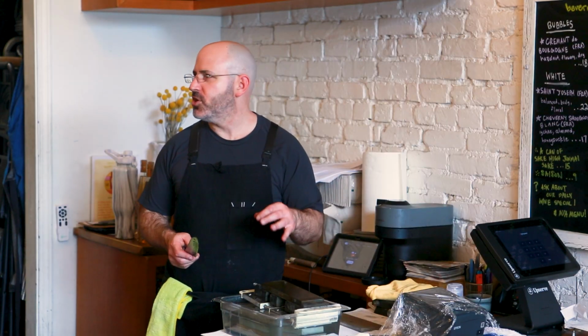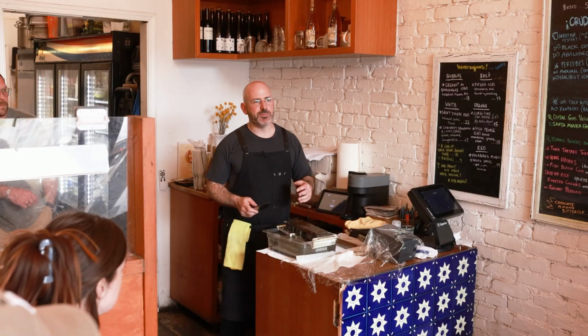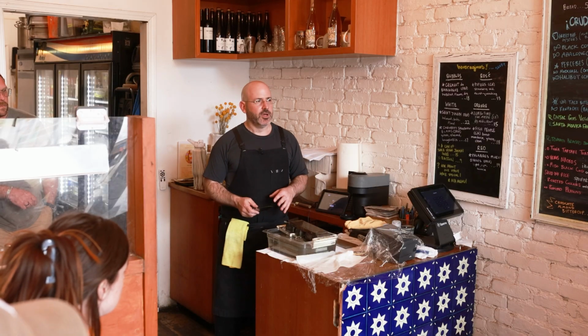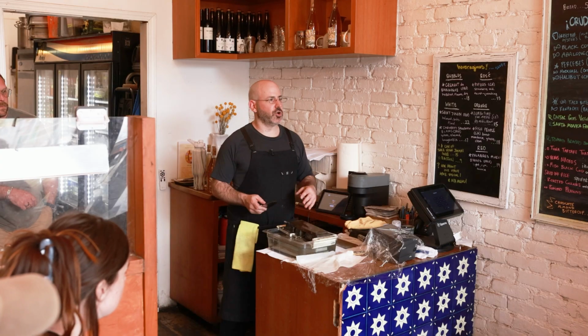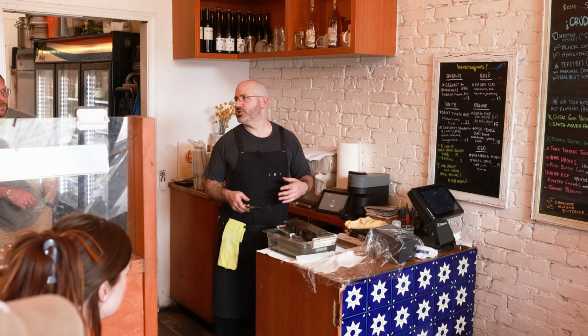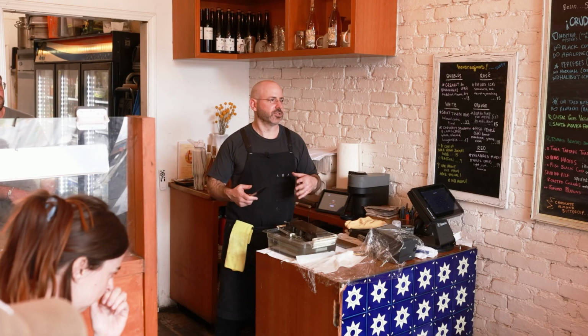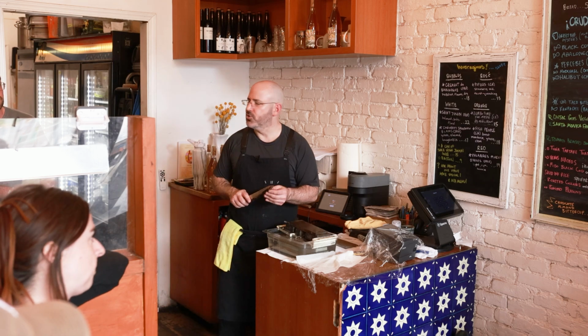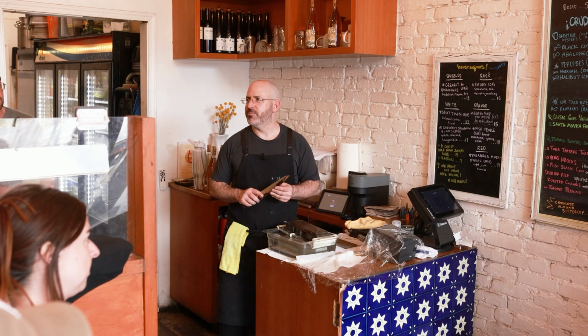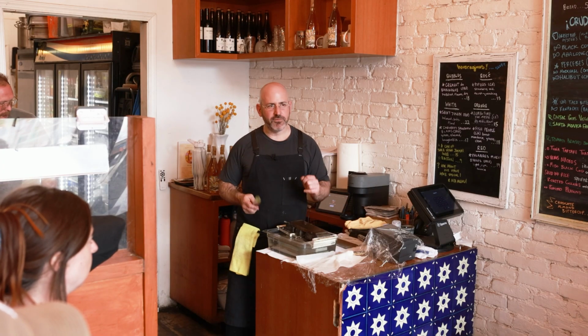You may spend more time than I'm spending here. It looks easy, but it's also because I'm hitting the exact same angle every time, and I've been doing this for a very, very long time. If you're spending 30, 40 minutes on one knife, you're messing something else up. Something is going wrong. So ideally, you should be spending somewhere between 5 and 15 minutes on a knife, unless you're doing a much more major repair. If it's going longer than that, I would start looking at what's going wrong in the course of your sharpening. Is your angle off? Something must be wrong there. So don't spend that much time. Don't blast through your knife metal-wise either. There are some guys who sharpen every day on a coarse stone, and every 6 months they're buying a new knife. Don't be like that.